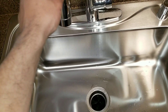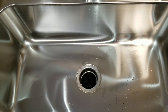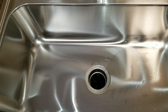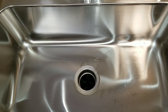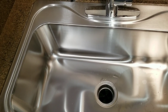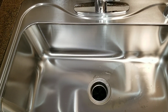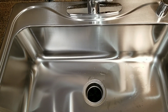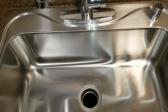On today's video we'll be dealing with a very common issue regarding the dishwasher. A lot of times I'll get calls and the tenant will tell me that their garbage disposal stinks. They've tried cleaning it, put Clorox down there, and it's a temporary fix — within a couple of days, even the next day, it'll start to smell like sewer. You want to understand that you have to find the source of the smell. Even plumbers will say don't use Clorox, use ammonia, but the smell is coming because of a source, and the only way to eliminate it is to find the source.